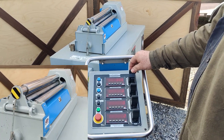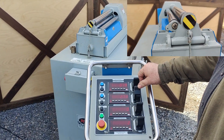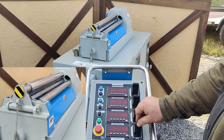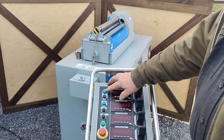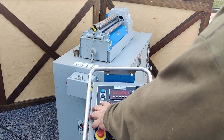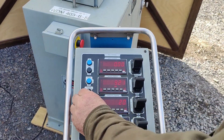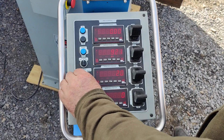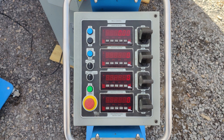For the Pre 4.2, which is an upgrade, you have joystick operation for forward and reverse, and joysticks for the far roll up and down, the pinch roll up and down, and the near roll up and down — just like the Beta, except it's joysticks instead of push buttons. You still have push buttons for the drop end up and down, a gauge button, a selector switch between normal, set point one, and set point two, another selector switch between normal, roll trim, and rotation re-roll, and a mushroom emergency stop switch.